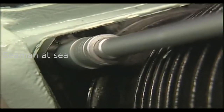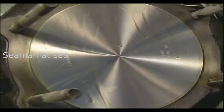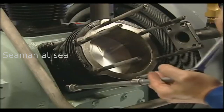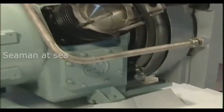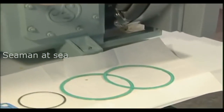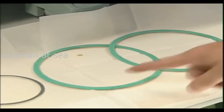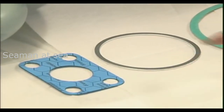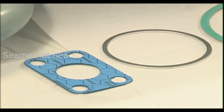Gently hand-tighten the cylinder base nuts. Then, by turning the crankshaft a single revolution by hand, a functional test of the piston stroke is complete. Only after that can the base nuts be finally tightened and secured. Any surface oil can then be removed. During installation of new or reconditioned valves for the first stage, four new gaskets are required: a flat gasket under and over the valve, a precision gasket ring on the concentric valve, and a flange gasket between cylinder head and cooler.